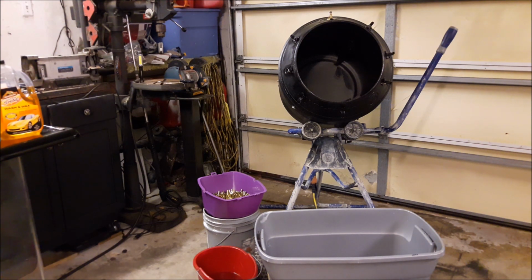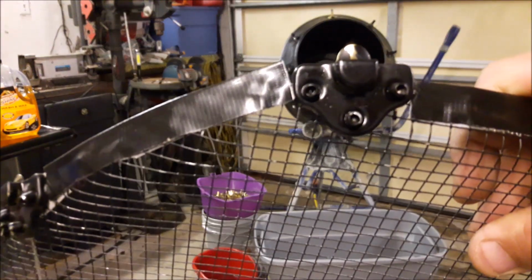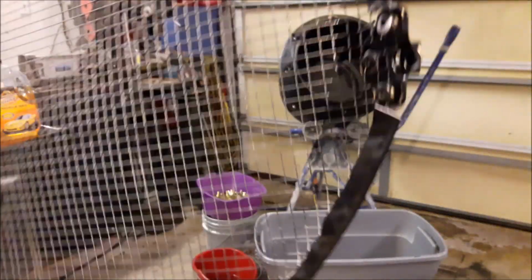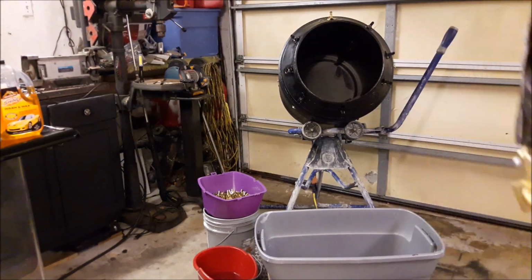I was worried that they would leak, or that the scrunched up part of the rivet would be exposed on the inside of the drum, but when you tighten the rivet, it actually sucks up inside of the holes drilled into the plastic, and you can't see it at all. It's also watertight. Now notice with these, I had to put the rivets in the reverse way, and that is so the rivet actually catches inside of that little 1/4 inch spot. This one's actually better because it's not painted.